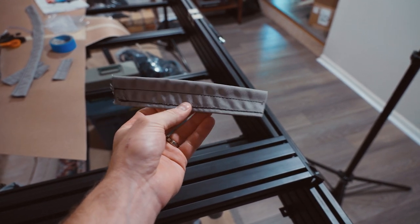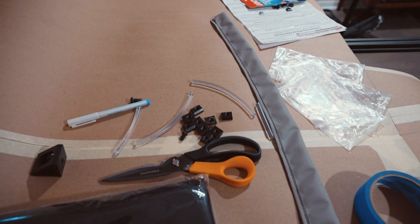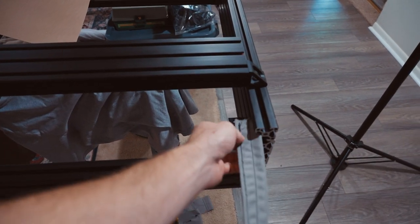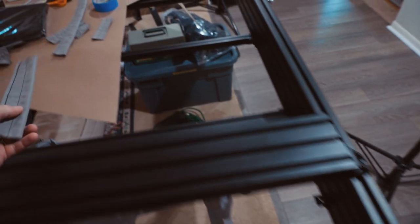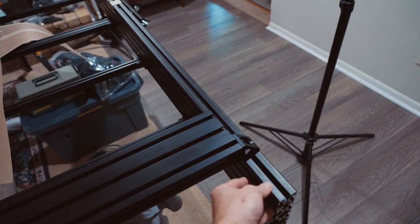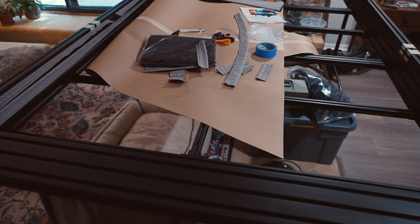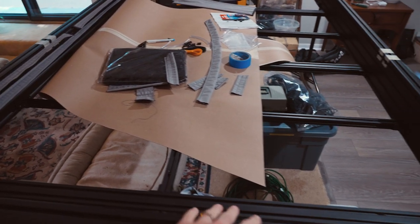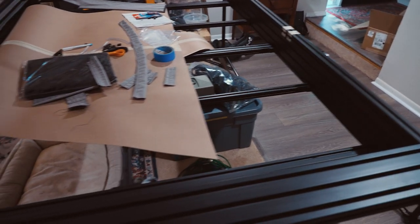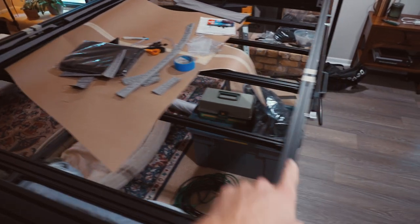With the help of a buddy who's really good at sewing, we made these little tab inserts. You can buy acrylic or plastic cord, and you slide it right into the tab, which then slides nicely inside the T-channel. The thought process is: fabric goes on the insides of the T-channel, and rubber stripping goes on the parts that will touch, to keep it waterproof. The bottom of the tent is reinforced with one-inch extrusions, using adapter T-nuts so smaller extrusion bolts work in the larger T-channels.